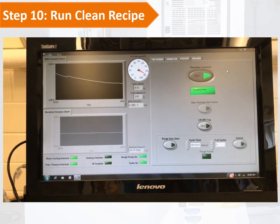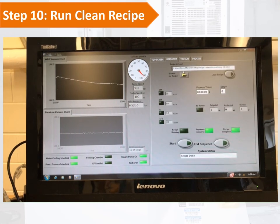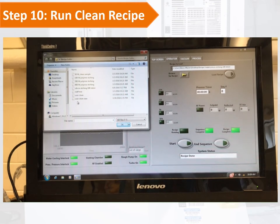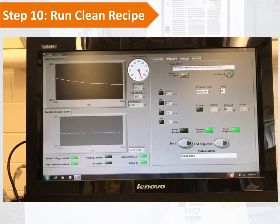Now we will talk about running the clean recipe. After your etch process, there will be some residue inside the whole chamber. We need to run the clean recipe to clean the chamber wall and also the holder. So we go to the operator menu, we choose the clean new recipe, and we load it to the system. Next, we go to the process menu here.